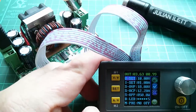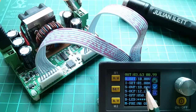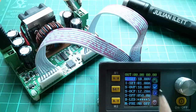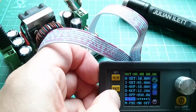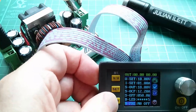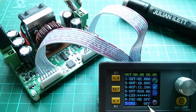Switching to the settings display by pressing Set, you can see a whole load of parameters. Voltage set — that's the voltage limit. Current set — current limit. Over-voltage protection: currently at 18 volts; if the output went over 18 volts, this unit would actually switch off, equivalent to pressing the on/off switch. Over-current protection and over-power protection in watts. The brightness of the LCD backlight LEDs — let's try adjusting that, you can see it goes pretty dim. There are memory presets, which are quite unfathomable to me at the moment. And the final item is initialization setting — whether the unit is off when you power it up or whether the output comes on when you power it up.